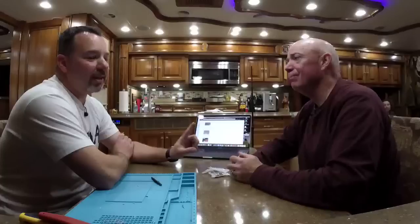Yes, I did. And just for people who may not know, at continuous use, breakers are only rated to allow 80% of their current, which is 40 amps for 50 amps. Even though it's a 50 amp breaker, they're only rated for 40 amps of continuous use. The residual 10 is burst, if you will. Yep. Short-term use. And the EV charging takes 40 amps. Yep, that's the maximum the EV chargers do, unless you're using a 240-volt system. Well, you can get a high-power charger. But that's all for another story.